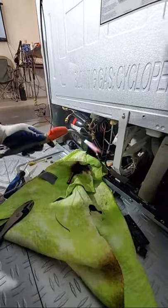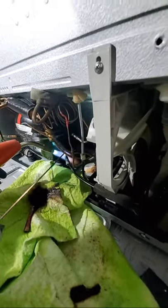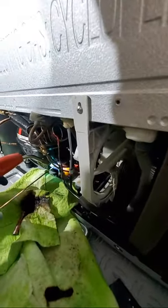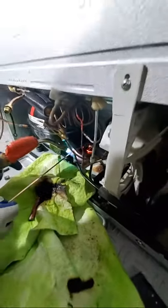All right. Wait till it gets a little redder. Fan it. All right, now start going. Go. Fan your flame. Watch your back grommet or your compressor. You're burning it. Control your flame.